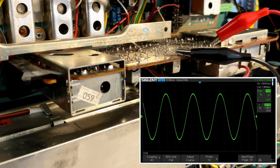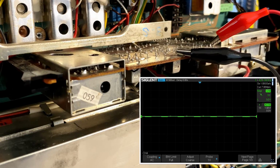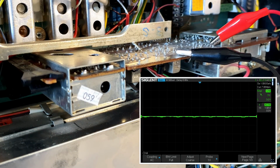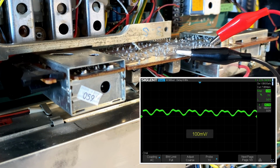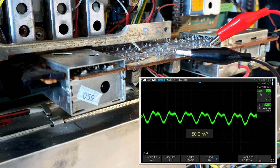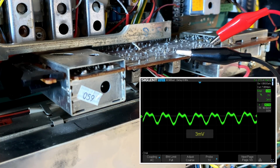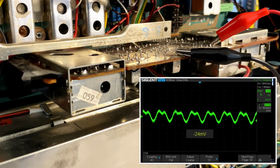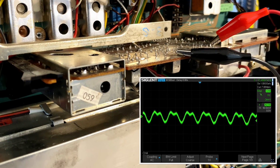Now I'm going to go to the modulation, and instead of type FM, I'm going to go type AM. And now I've got AM modulation, depth of 30%, AM frequency is 1 kilohertz, the same as before. And as you can see, it's sort of disappeared from the scope. If I change this to speaker, I can hear it. I'm using the benchtop speaker at the top there, but I want to see it on the scope. Let's see. It's a very small signal. Very small signal, having problems triggering. If I take off the modulation, it disappears. Put it on, it's there.